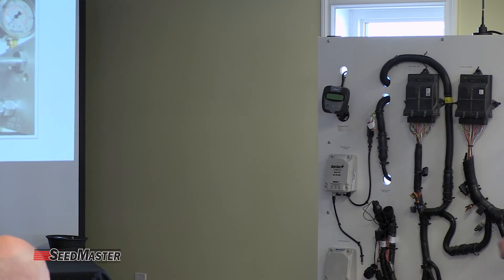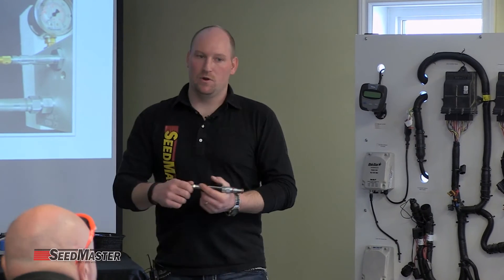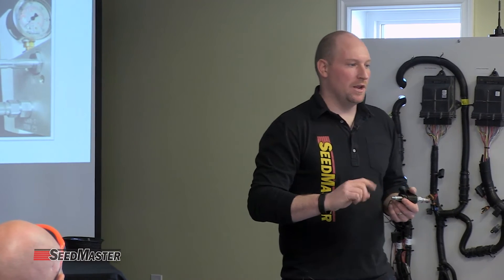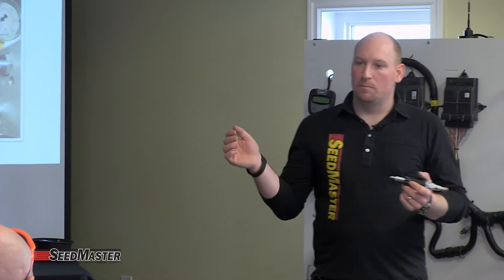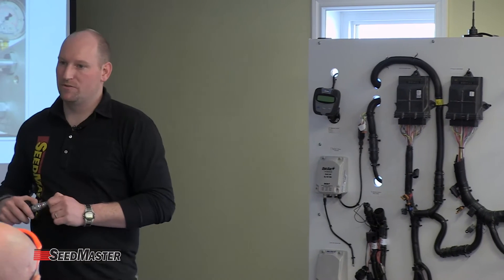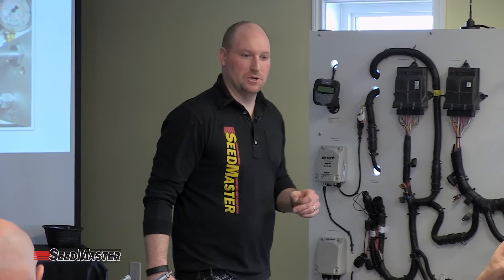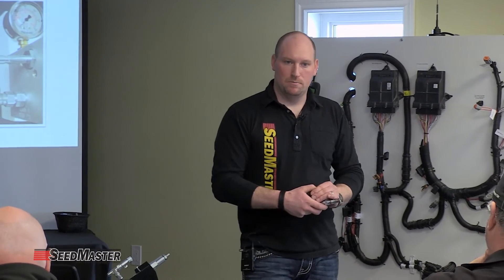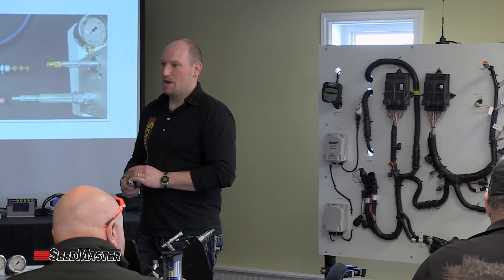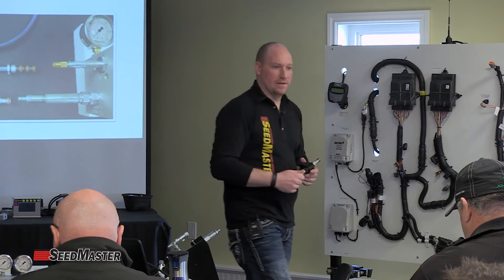The other thing I want you to know about is that on-off valve — when it goes around, there's a brass knurled knob on the end. You can actually pull it out, turn it a half turn and it locks it open. And if you keep turning it, it'll actually turn and pull closed, which is a manual override. So sometimes it's nice to be able to turn your opener pressure on by yourself. If you're working by yourself and you want to be sure that your opener pressure is on and off, you can turn it on and off a few times. There is a manual override right at that block.